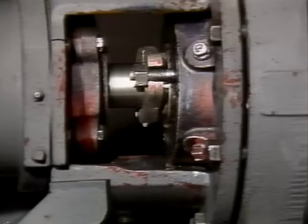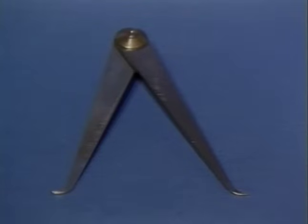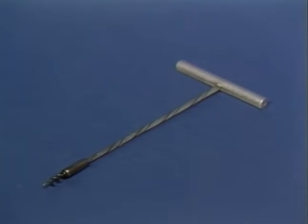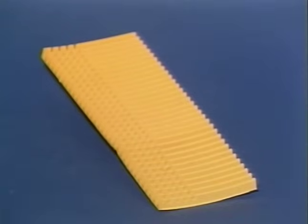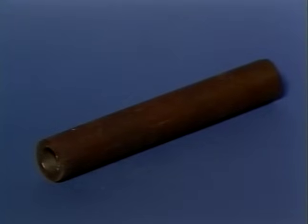Adherence to these steps will result in packed pumps that operate more efficiently and effectively. To properly pack a rotating pump, the following tools will help make the task easier: appropriate wrenches, a vernier scale, inside-outside calipers, a mirror and a flashlight, a flexible ruler, a flexible packing extractor, a tapping tool, a cleaning solvent and fine emery paper, a mandrel of appropriate size, and a packing knife.